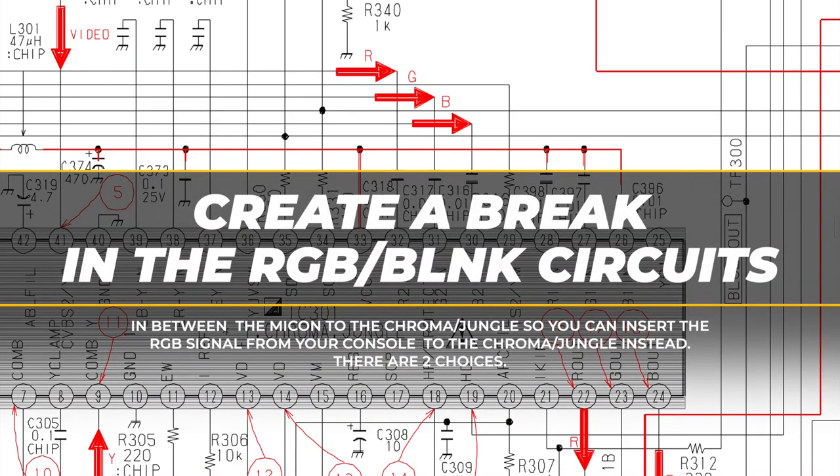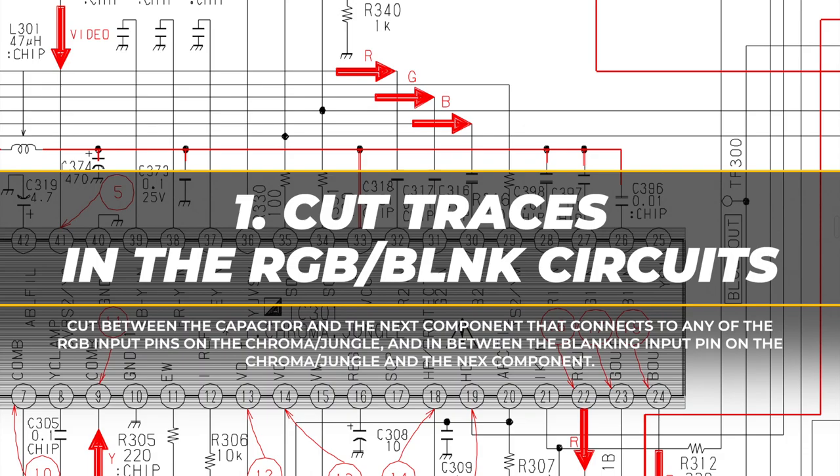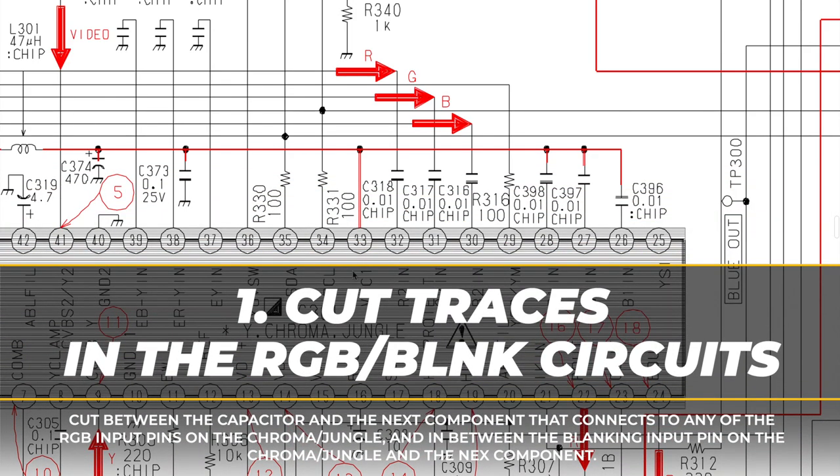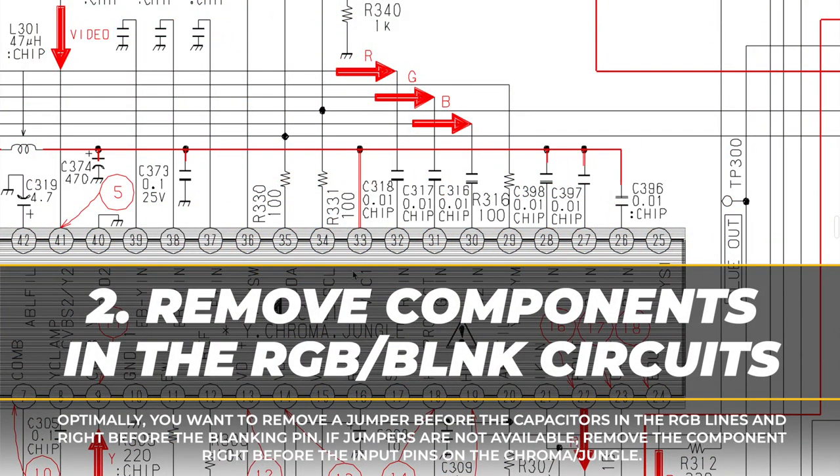The game plan is always to create a break in the RGB and blanking circuits. A break is needed so you can insert your own RGB and blanking signals from your console. There are two ways to do this. One is you can cut the copper trace. Or two, you can remove components.